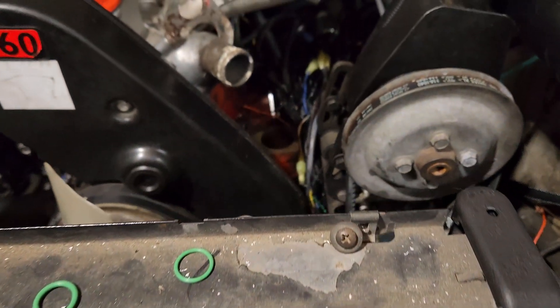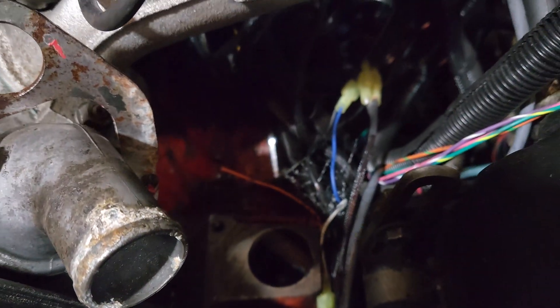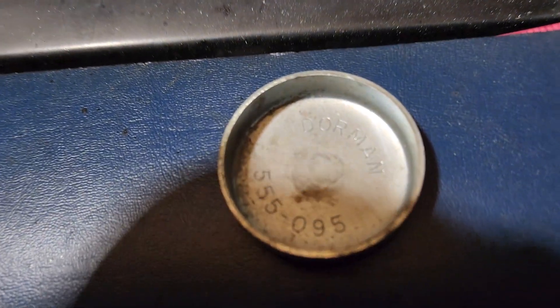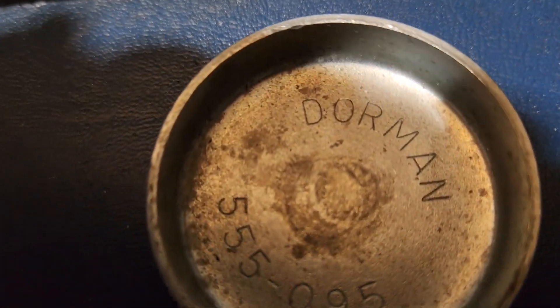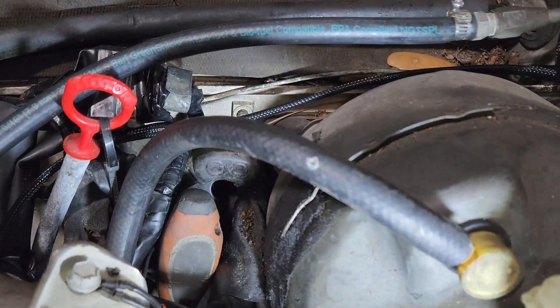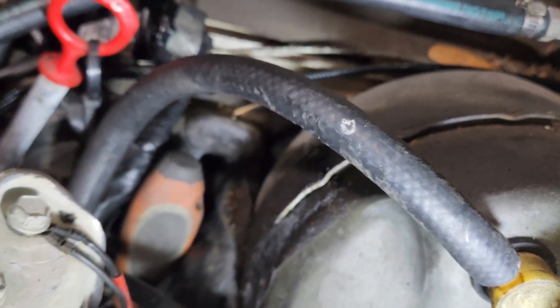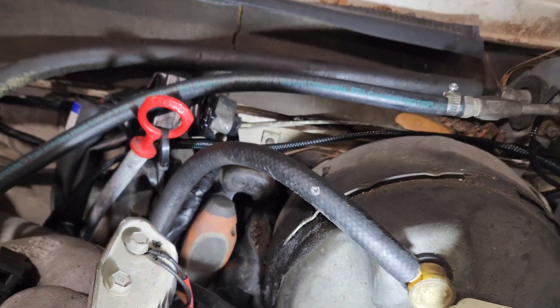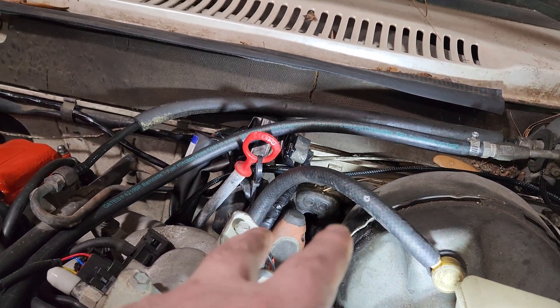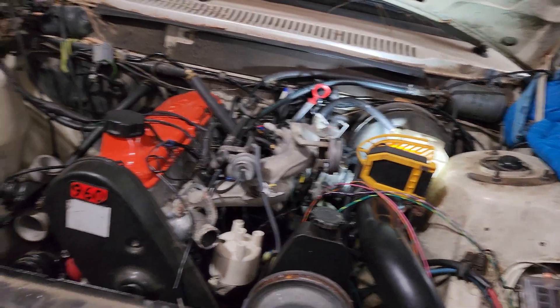Go on, get in there — you know where you want to go. Why are you staring at me? The throttle cable was a lot of fun to get to because I had to use one flat-headed screwdriver to pry that harness plug out of the way. There are two bolts, one here and one here, Phillips head. So that was a lot of fun.